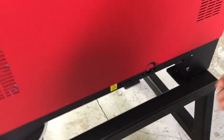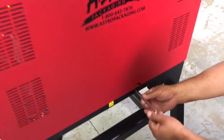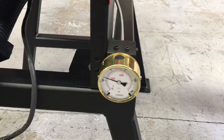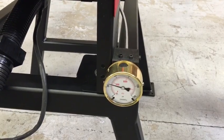For pressure on your AP100, go to the side and put in a quarter-inch Allen wrench — turn it up for more pressure, down for less pressure. That pressure can be read at the liquid-filled analog pressure gauge. Watch it go up and go down, and set the pressure to the flow or bead size that you want.